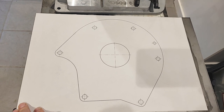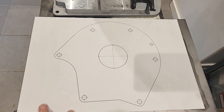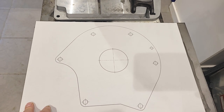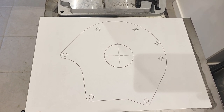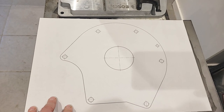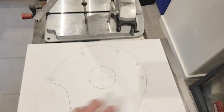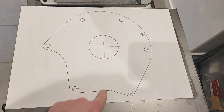This is a very agricultural way of doing things. I'm really doing it this way to prove I've got the spacing right and to prove the motor is better than the other one. What I don't want to do is invest in getting something nicely machined out of aluminium, only to find A: the bolt pattern is wrong, or B: go through all this rigmarole to find the new motor is no better than the old one — because I've not really tested that yet, certainly not with the Prius inverter. Yes, this could be lighter. I'm sure there are a thousand ways this design could be improved. But it works on my existing car. I've got 8mm steel plate on there before and massively over-engineered it; this one's come down to 6mm.